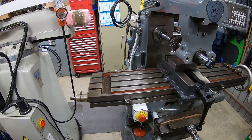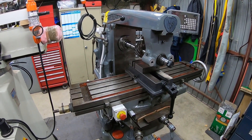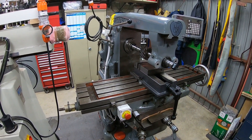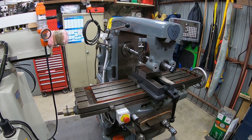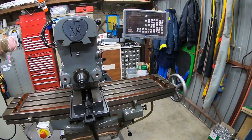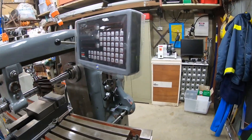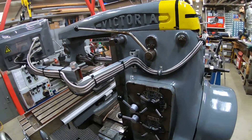The main purpose of this video is to talk about fitting a DRO to this machine. The fact that the table rotates made it a particular challenge to find ways to attach the scales and also to cable it up, so I'll be talking about that. Attaching the readout was relatively simple, but I didn't do it the way a lot of people seem to, so I'll talk about that as well.